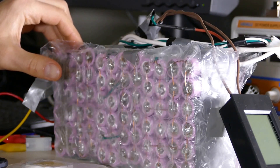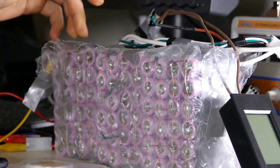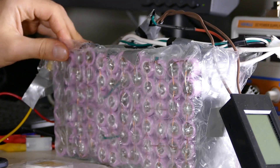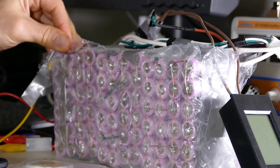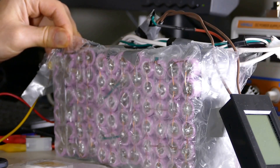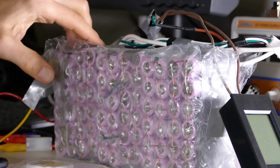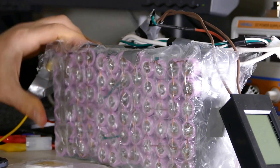When I was putting the pack together, I may have included some batteries that were a little over voltage. When measuring each battery they should be around 3.8 volts, which is normal, but a couple of batteries were at 4.1 volts — maybe three or four batteries around 4 volts. I think that may have screwed up the voltage of the pack.